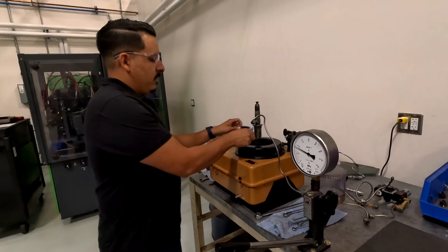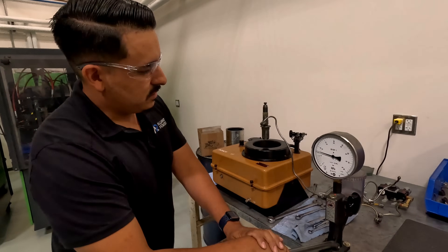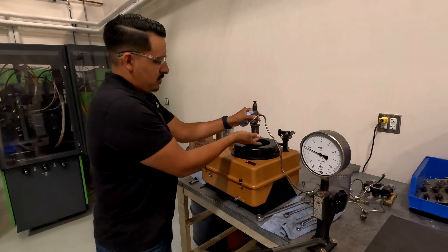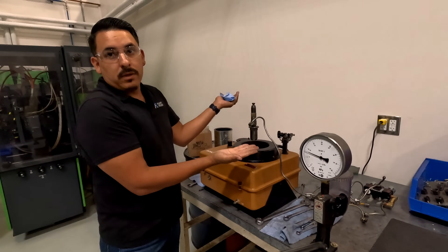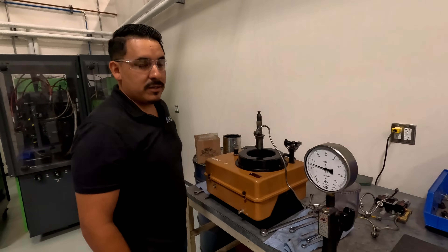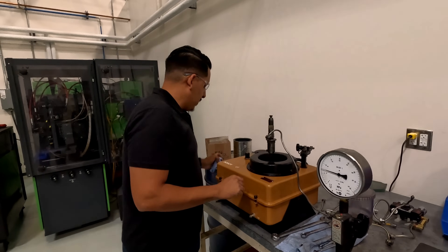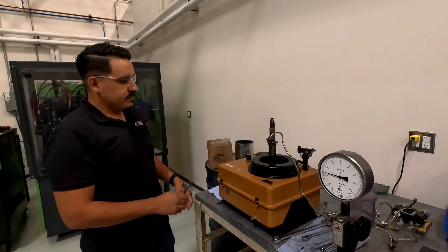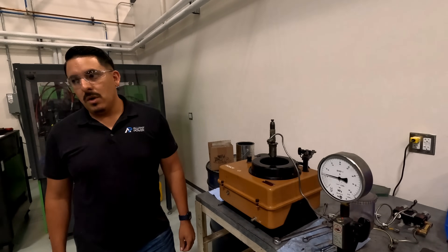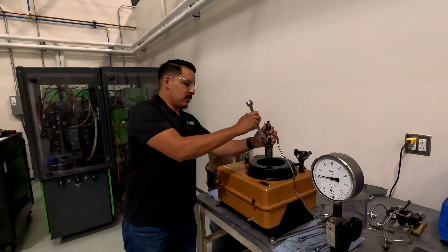The tell-all is going to be 10 bar before — and that's clean. It's clean. This might just need a little bit of an adjustment to get them consistent. In my opinion, that's not a bad injector — and that's one of the ones out of the other tractor.